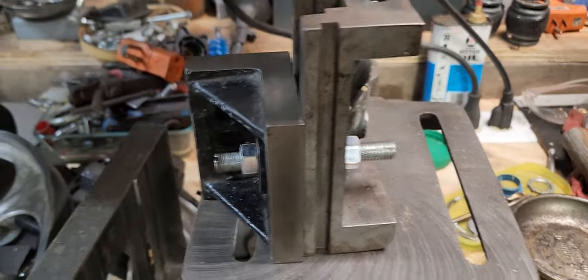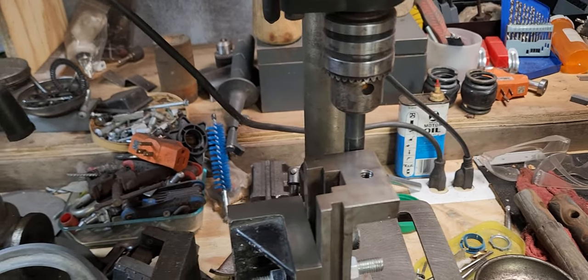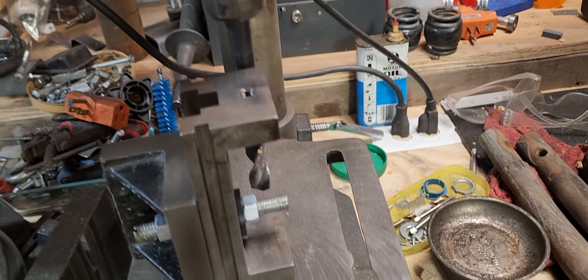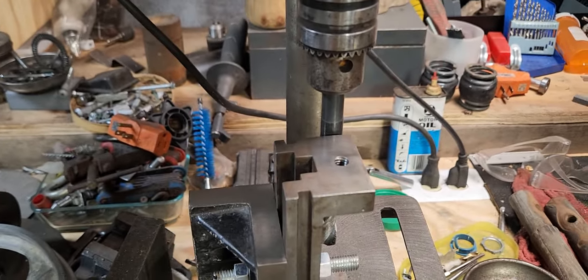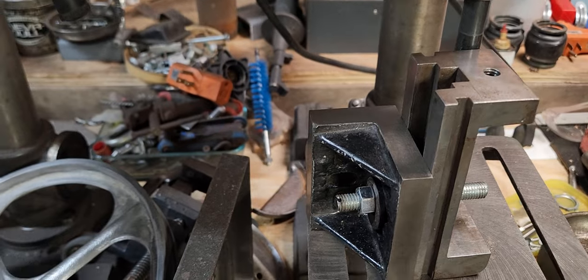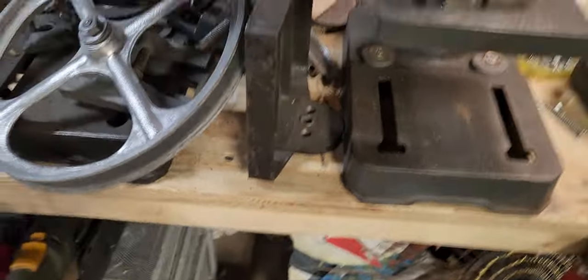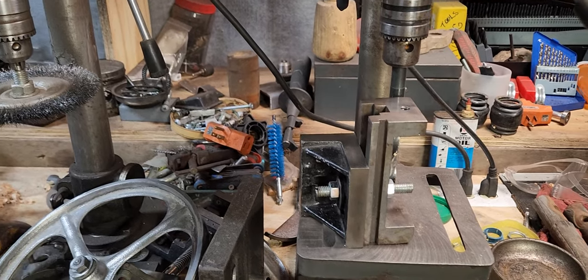But before doing all that, mark them holes out, pin set them, drill them, tap them, press the bushing in there, the brass bushing, put the screws in it. Still got a machine to screw down. You gotta cut it down, machine it down. And then figure out what we're gonna do for a handle. Man, we're still flattening this.